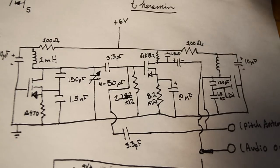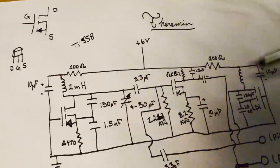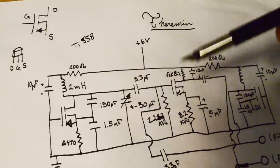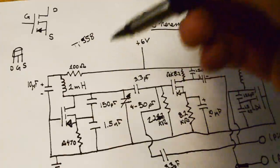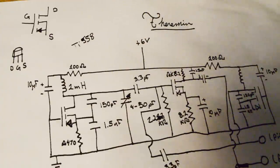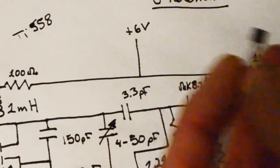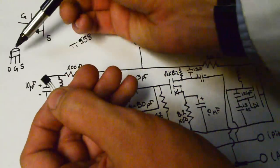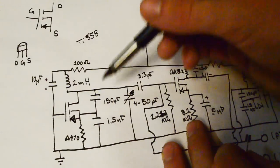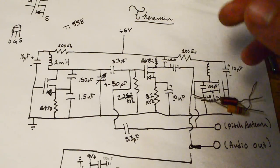Probably most any JFET will work for this circuit. Try to have the two end ones identical for the similar frequency thing I was talking about, since the properties might alter something. The JFET I'm going to use in particular is the TI-S58, which is the only one I could find in my local electronics shop — it looks just like a little guy, kind of like a 2N3904 transistor. If you're following along exactly with me, the pinout with the flat end facing you is: drain, gate, source.